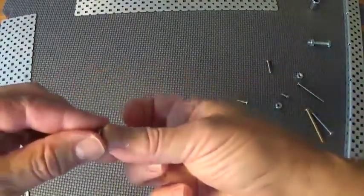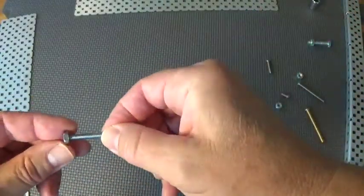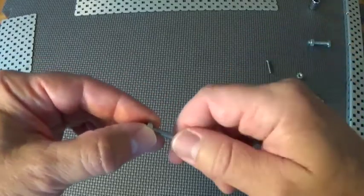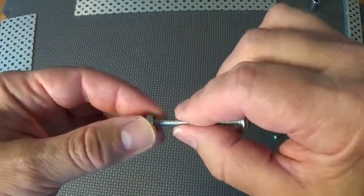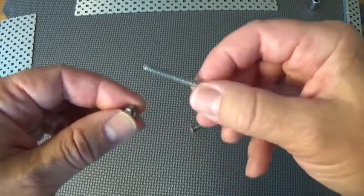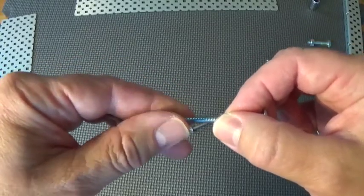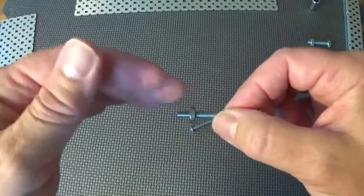There is a problem you can sometimes encounter when trying to screw things together. It doesn't happen very often, but you can get something called cross-threading — that's where the nut doesn't quite get on to the screw quite right, but people will force it and force it, and you're essentially cutting new grooves into the inside of the nut. You can get like halfway down before it just totally jams. To avoid cross-threading, put your nut on and then turn it the wrong way just ever so slightly — maybe a quarter of a turn — and then turn it the proper way. That helps prevent cross-threading.